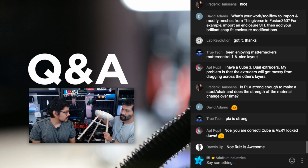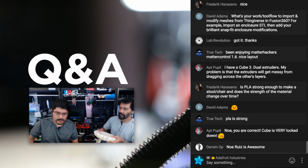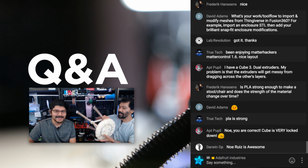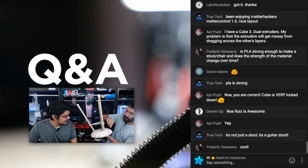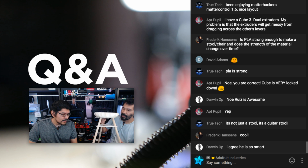Okay. Let me check that out. The PLA would have been too brittle and definitely would have broken when you sat down. We tried it, and you sat on it, and it crunched. It did crunch, yeah. It has a crunchy sound to it. The little bottom parts right here weren't able to hold up with regular PLA. But with PLA/PHA, it works beautifully.